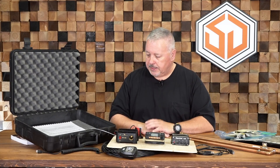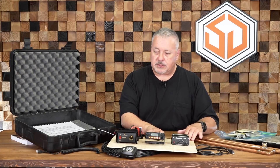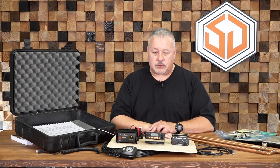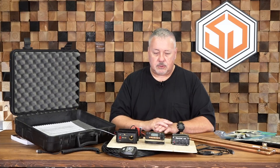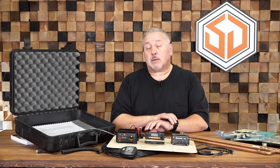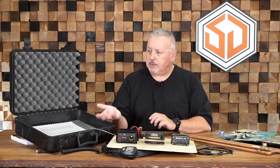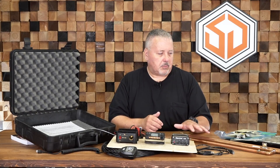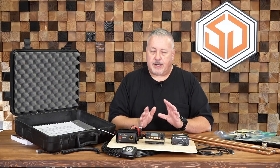And that's it, really. Hook your power up, hook it to an antenna, and you're good to go. This will do voice if I plug the microphone in, or it will do digital modes on three bands: VHF two meters, 70 centimeters (the 440 band), and the 220 band — which is where I kind of like to go with this. We've done some experimenting with low power and you can go quite a considerable distance if you've got your antenna up high enough. With most of these things, it's all about the antenna — the higher you can get it, the better. You can use a wire antenna if you want, or coil it up and put it in the box.